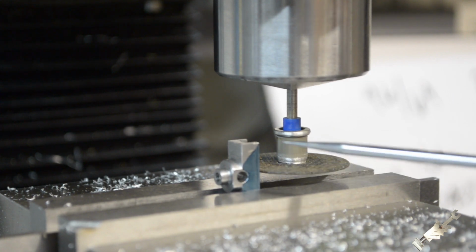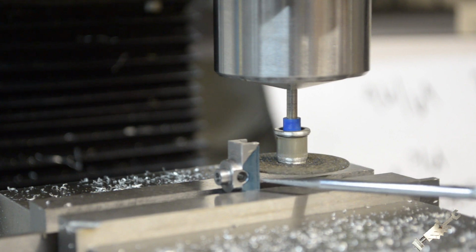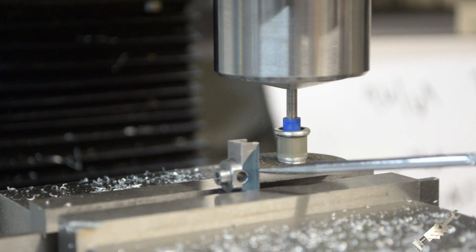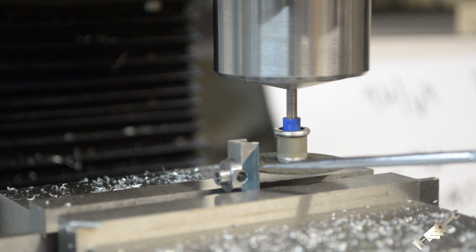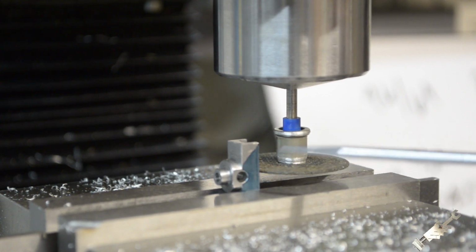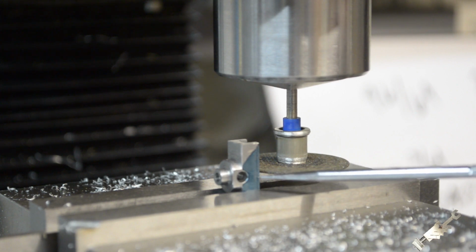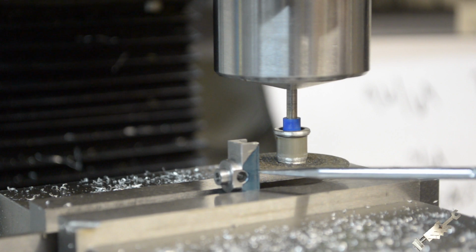The plans call for a little slot to be cut out on each side of the yoke, and that's to give clearance for the exhaust to come out through the center of the crankshaft as the yoke passes over the center. So it calls for a 1/16 of an inch wide slot by a depth of 3/64. Now I don't have any 1/16 of an inch end mills,